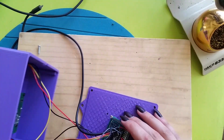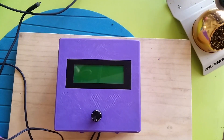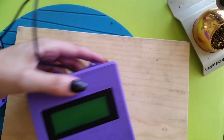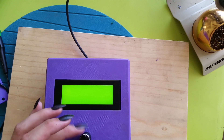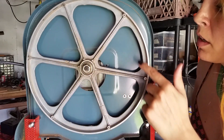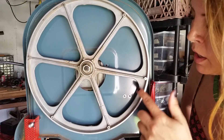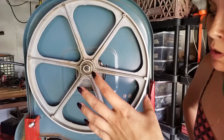Now to put it together and mount it on the saw. On the bandsaw, you can see six magnets glued around the rim. Theoretically you only need one to measure a revolution, but for accuracy I wanted more readings — six, because there are six spokes. I'll put the cover back on and mount the sensor.